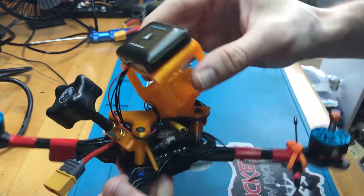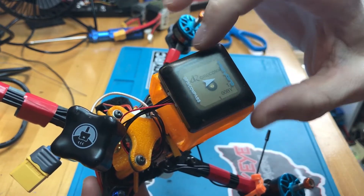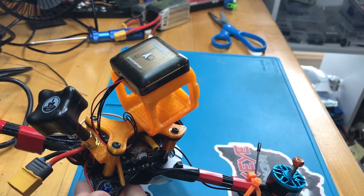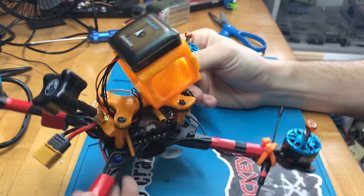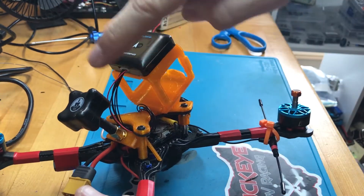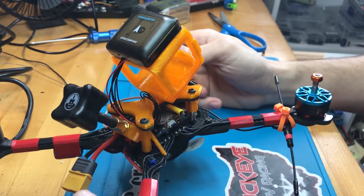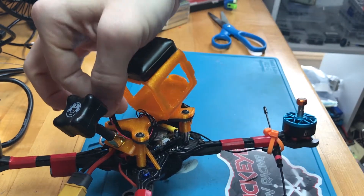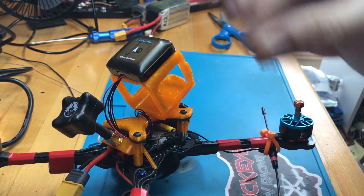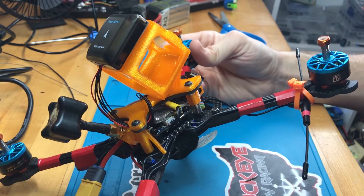On the front plug you have your UART3 and UART6 — it's a 6-pin plug with 5-volt out and ground, which coincidentally is what this Holybro compass takes, from getfpv.com. I'll put the links to all this in the description so if you want to build this exactly as-is you're guaranteed to have everything work right, and I can post the Betaflight diff for the configuration. I just looped the wire around once and ran it into that front 6-pin plug. I did have to rearrange the pins using a little tool to pull them out and swap them around to match the Omnibus pinout.